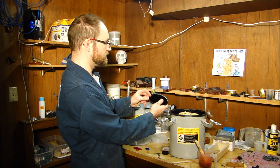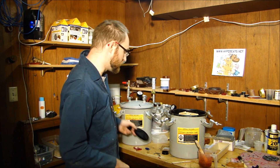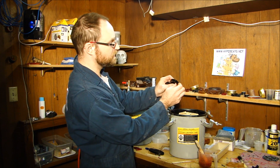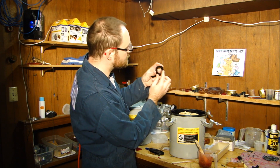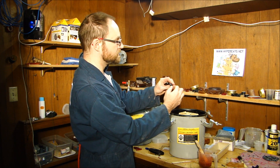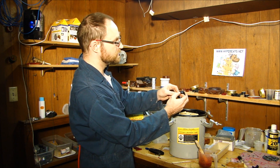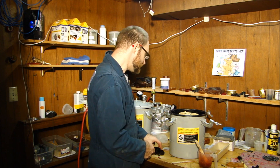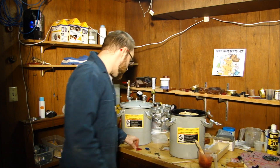If I were going to do something like this without pressure casting, there are a lot of tiny little undercuts and little pock marks and goofy spots that would just hang on to air bubbles. I can do all kinds of complex shapes — like this piece is basically nothing but undercuts, no matter where you pour it from — but I can do this with zero air bubbles. Both the lips and all the grooves are super durable because there are no air bubbles, compared to just pouring resin in and having air bubbles all around it.